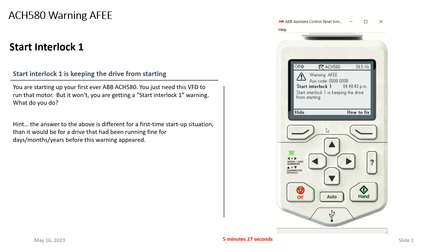Now I'm talking to the person where the drive has been running for years and all of a sudden you come across it with this message — it's supposed to be running but it's not. If it had been running in the past, there's a very good chance there truly is a safety wired into digital input four. Maybe that's a high static cutout on your air handler, a vibration switch on a cooling tower, a smoke detector on your return air, or a fire stat sensing too high a temperature. There are many different safeties in the HVAC industry, and Start Interlock 1 is that safety input. So if it's been running fine and now the safety opens and you've got this message — don't do what I just showed. There's a reason it's not running. Your safety has told the drive it is not safe to run.